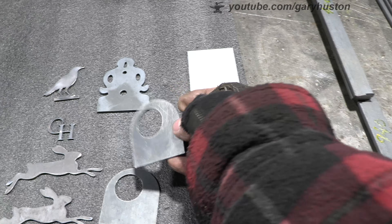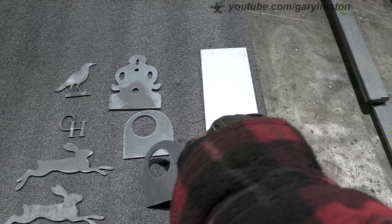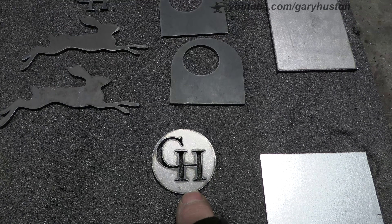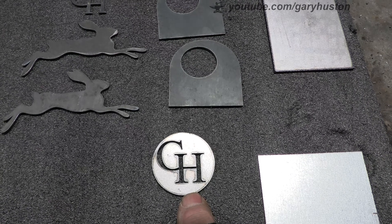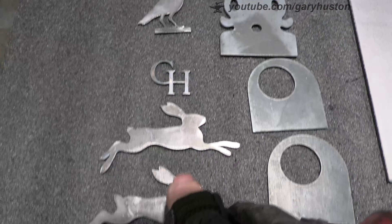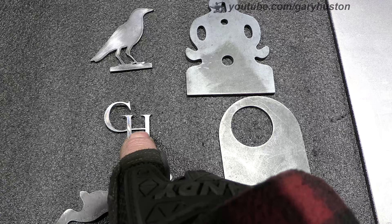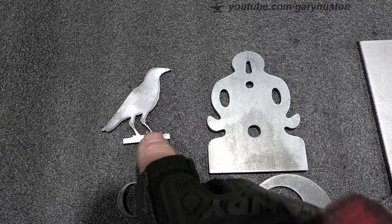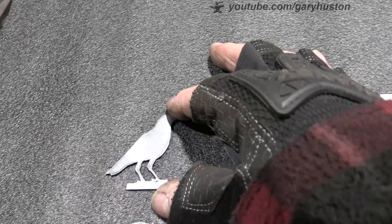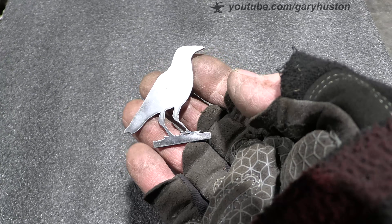These are a few more things I did earlier - I use those on the white line machines. I normally do them with the plasma but wanted to see what they come out like with the laser, and they are much much better. I just wanted to do everything small so I could see how much detail I could get, because this is going to be great for sign work. On these, the detail - I normally cut them about a foot long - that bar in the middle of that is under a millimeter wide. It's just incredible. The crow's legs are even narrower; the detail is phenomenal. I normally do them about 10 to 12 inches tall, and that is incredible detail, so I'm very impressed.